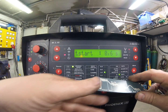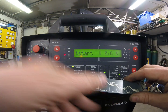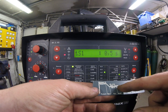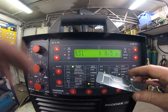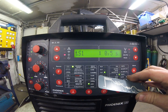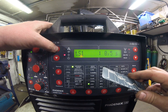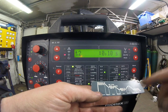We've got 0.6 of a second there, fully adjustable. Time slope 1 is how long it's going to take to slope from our hot start current down to our main welding current — half a second. I like to have slopes in these things; it stops you getting such defined ridges in a weld when it goes from one current to another, and phases it out more smoothly. But again this is entirely user-settable and can be configured entirely to your preferences.